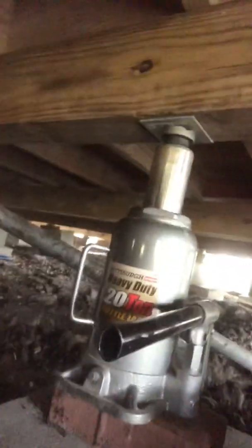You can see I have one jack, two jacks, then I have my post — my jack post. I like to do the middle and both ends of whatever I'm doing. But don't put your jacks where you want to stack underneath your beam — it's better to lift your beam as well.